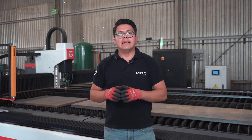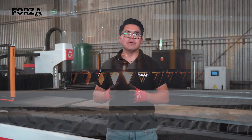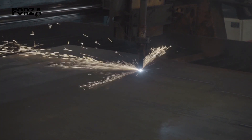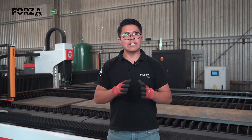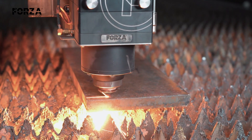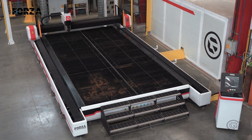The choice between plasma cutting and fiber laser cutting depends on the specific requirements of the job. Laser cutting is ideal for tasks that require high precision, high quality cuts, and thin materials. Plasma cutting is more suitable for thicker materials, applications where maximum precision is not needed, and situations where the initial cost is an important factor. Both methods have their own advantages and disadvantages, and the right choice depends on the specific needs of the project and the materials involved. In summary, fiber laser technology can perfectly replace plasma, even for thick materials. If you're looking for precision, quality, and less post-processing, fiber laser — especially a machine like the Forza Goliath — is definitely the right choice.